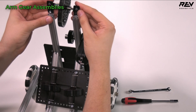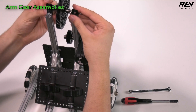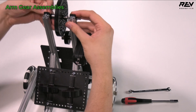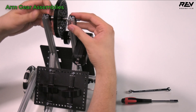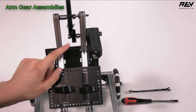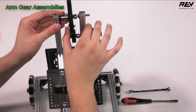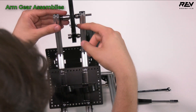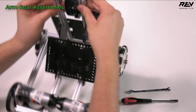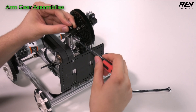I need to start up here and get these nuts in the slot. As it comes down, make sure these are lined up — grab your nut driver if you need to. You'll see the gear is coming in but it's not meshing very well with this gear. So with the pillow blocks in place, just push this gear over until it's pretty well lined up — this can be adjusted as well. We're going to keep this approximately flush at the top and snug these pillow blocks up.